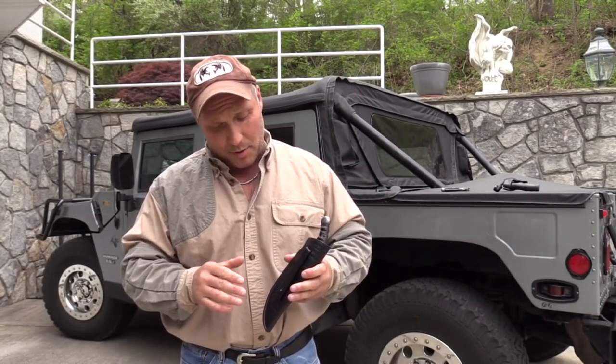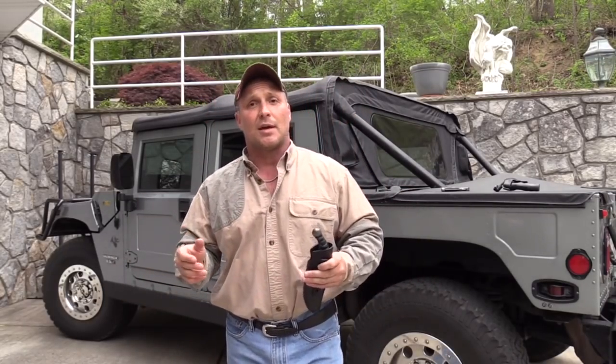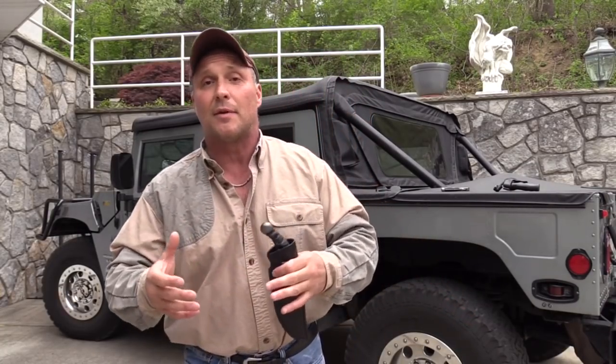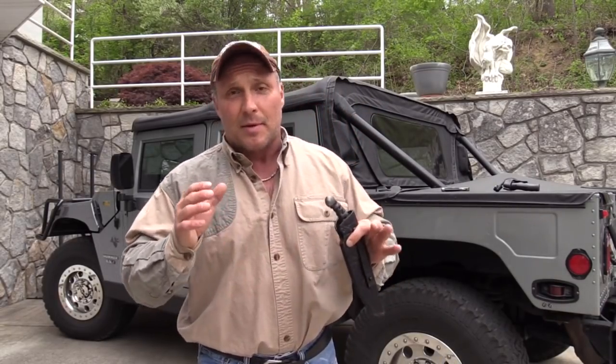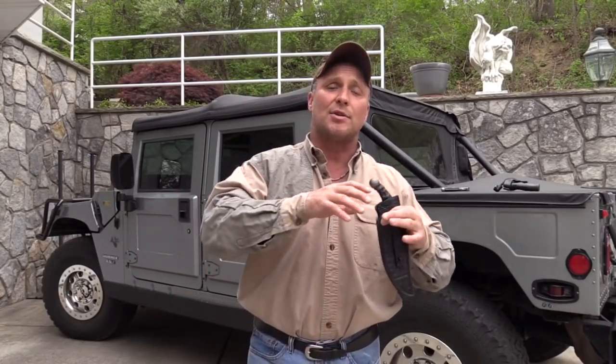What we decided on doing was this would be David's first integral. If you're not familiar, an integral is basically, you can do it either by machining it or forging it. David, of course, is a master that works in the medium of forging. The blade, the bolster, the hidden tang, all the way to the end is all forged and shaped out of one piece. He then adds handle scales, overwraps, etc., etc.